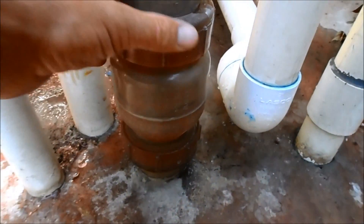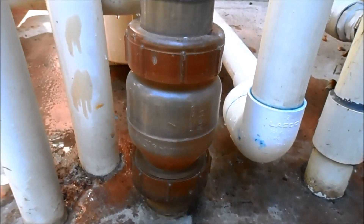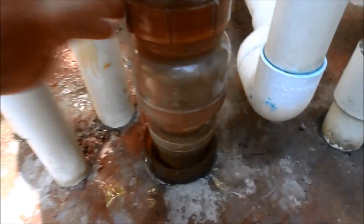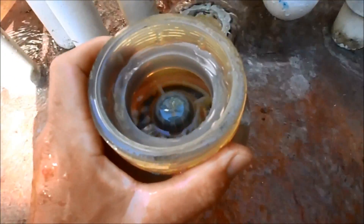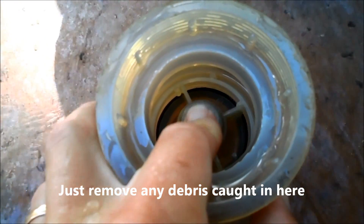Here's another type of check valve. This one just unscrews with these unions here. I've had to take this one apart a couple of times when a piece of plastic got stuck inside. The unions just unscrew and you can pull it out. Right here in the plastic it was keeping the valve depressed, and that's where water was leaking out and draining the spa down.